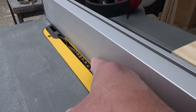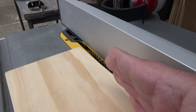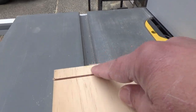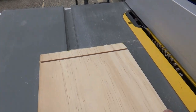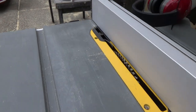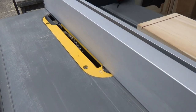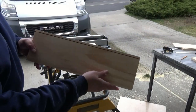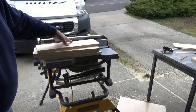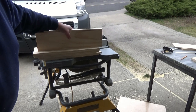I've set the fence a quarter inch from the back side of the blade and we're going to run our board through. Then we'll move the fence over an eighth of an inch and make another groove. Hopefully when we're done we'll have a channel that the bottom will set into when we put our drawer together. We don't have to raise or lower the blade since it's already set. Let me make a couple cuts, test it out. We got our groove cut, moved the fence back from the blade, made our second cut, and we'll test to fit our quarter inch bottom.